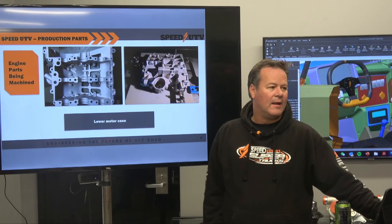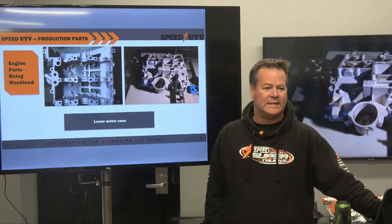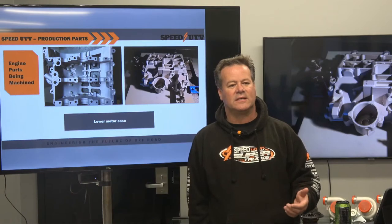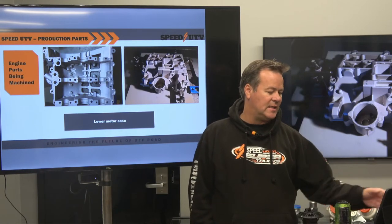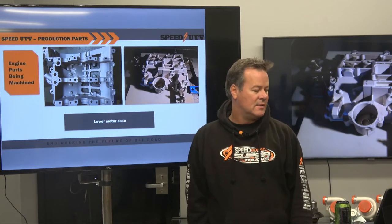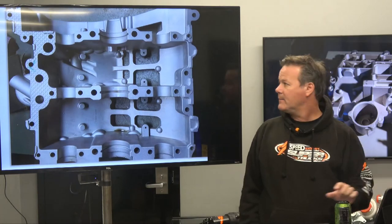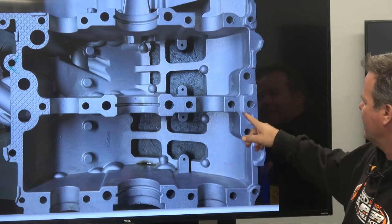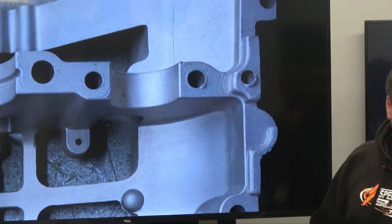On Sunday night we showed you parts, and now back on Thursday we're showing you more parts and more details because we're getting more pieces. There's the process of design and then the process of making the molds, castings, forgings, and all the tooling to be able to make parts. We have made changes on some of our parts throughout this testing process. Lower motor case is up. I'm really excited about this raw casting - if you look at how tight the pores are on the aluminum, this motor case is beautiful.